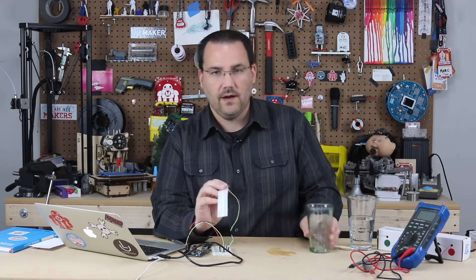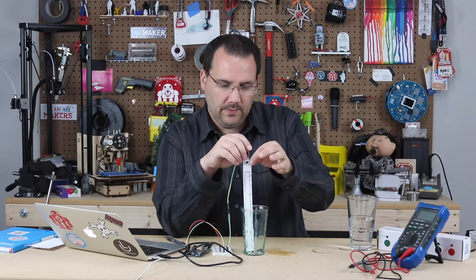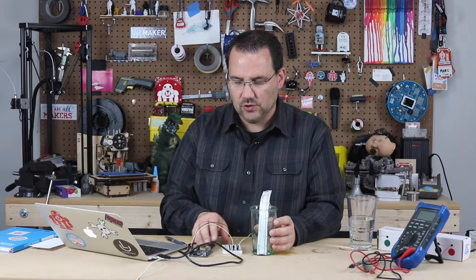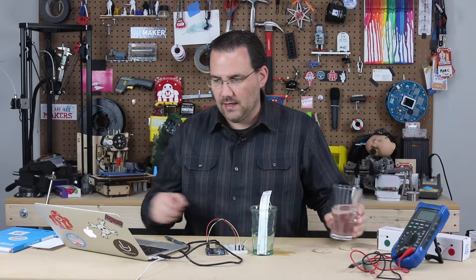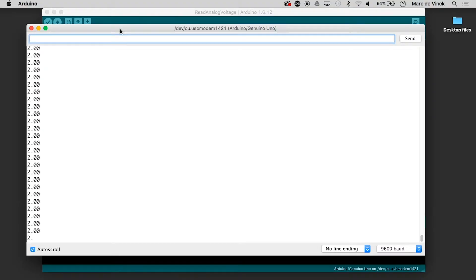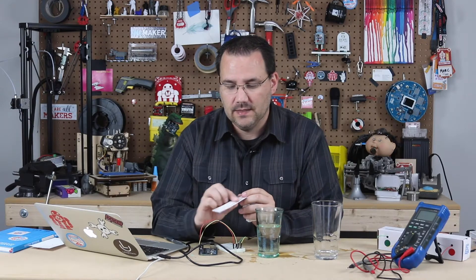Now this has some very specific usages. You're supposed to attach it straight using either food-safe silicone or clipping it to the top of your container — it really shouldn't be bent. I'm going to bend it; I'm not that worried about accuracy right now, I'm just showing you the basic setup. I have 1.99 right now — 9.6, pretty close. Let's see what happens when I add some water. It went up all the way to 2 volts. So it did work, but it's not calibrated. I could probably use a smaller resistor and get much finer measurements out of here.